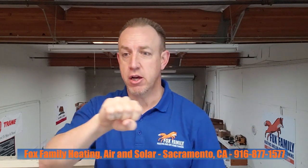Another good thing about running microinverters is that instead of running high voltage DC circuits carrying 600 to 1000 volts across the rooftop or through your attic, with microinverters we're running AC circuits literally from the panel, because that's where it got converted. We're running AC across the roof or through the attic, which is more commonplace for your house to have AC wires running through your house instead of DC wires.